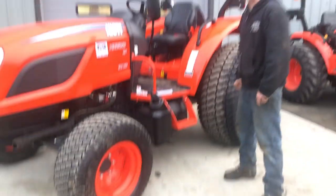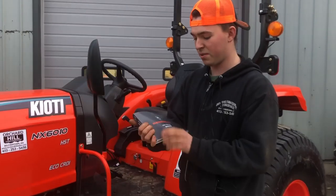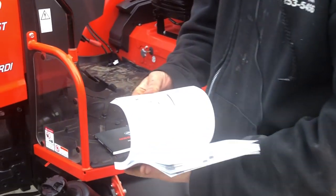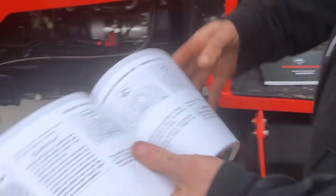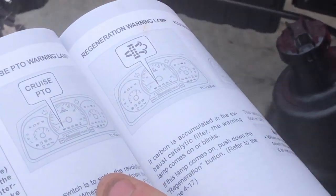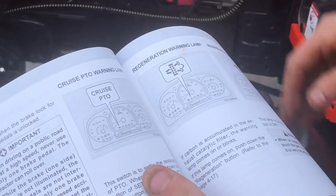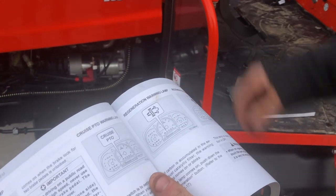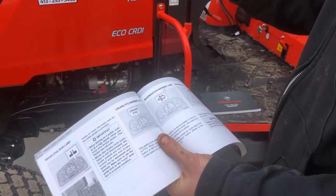Basically this whole video is to show you a regen. You've got the operator's manual and every single one is different, but this is the NX1 — it's not quite as explanatory as the CKs. You've got the two DPF regen lights here. This one means if it flashes once, your DPF is 120 to 160 percent full. Maximum is 200 percent — if it flashes, that means you're almost at 200 percent, and you better do a regen before it throws a check engine light.